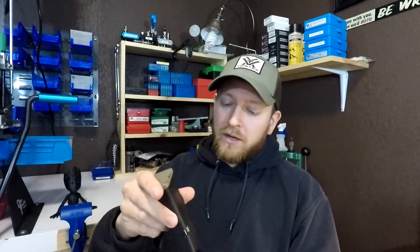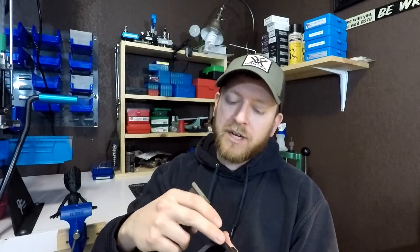One of the things I'm going to change is I'm going to chamfer the edges here on the top. With this Glock mag — this is an OEM Glock mag — it is a little bit hard to put in there because there is a lip right there that catches, so it won't go in perfectly. I'm going to go ahead and chamfer both sides so that you can put it in either way.